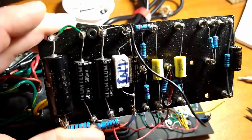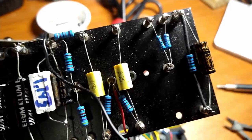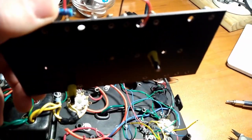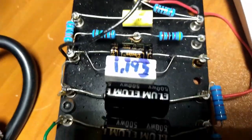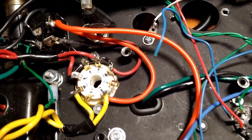Got the board out. As you can see, we used the blue metal resistors. Amazon specials, I'm sure. These were our standoffs. Wrote down the exact resistance on the power tube's cathode bias resistor so we could bias it. It's a nice touch. So I didn't do everything wrong.